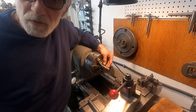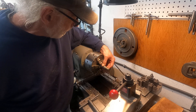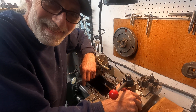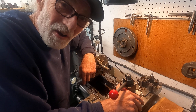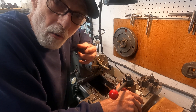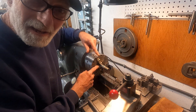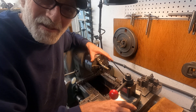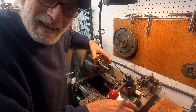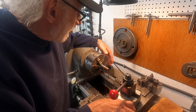Here's something about a six-jaw chuck you might not know. If you look around on the internet you'll see six-jaw chucks with only three jaws in them. The reason is the chuck wore out so badly that only three jaws remained in contact — and those three jaws will always behave like a three-jaw chuck. The other three jaws, which lost contact, get pulled out and put in a drawer somewhere. That's why six-jaw chucks show up with only three jaws.